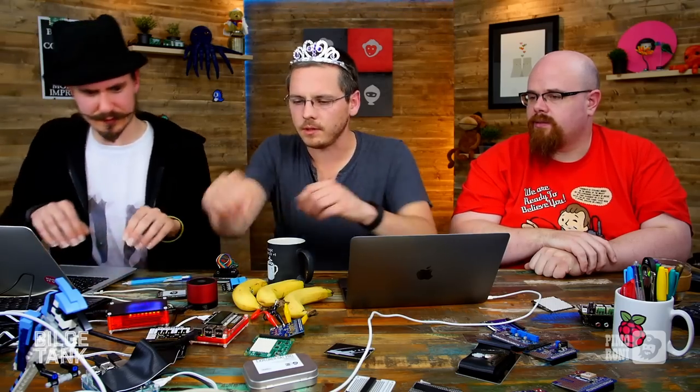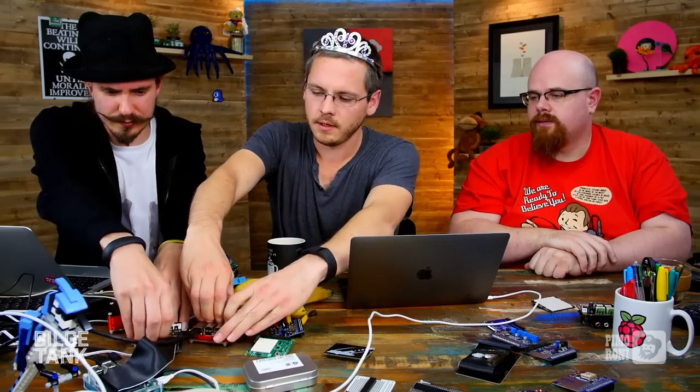I think the protocol is compatible with the HD44780, and that includes, I believe, the 4-bit, the 8-bit, the SPI, and the I2C interfaces. However, this specific model doesn't have the I2C pins out, but it does use the same driver chip. And the other thing that's quite nice about this is it's a 16x3 display, so you get another line of information in there, which is pretty cool. Yep. I'll switch over.